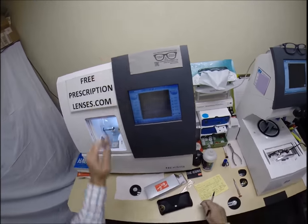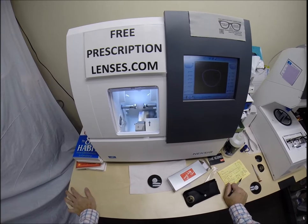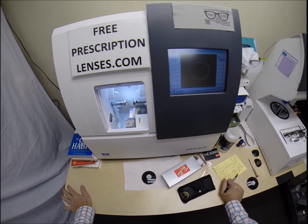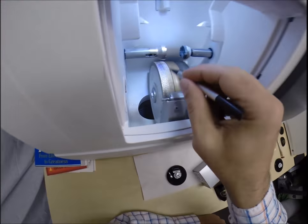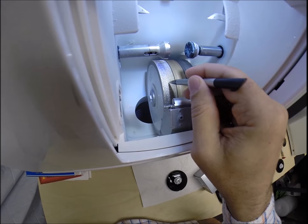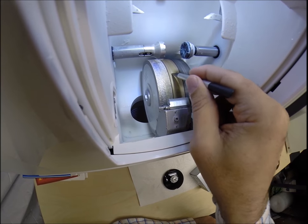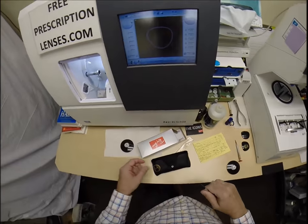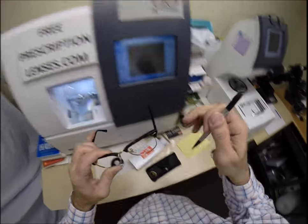This is the edger — this is what costs forty thousand dollars, it weighs 200 pounds. It'll do all the work while I run my mouth. I recommend everyone go out and buy their own, then you can cut your own G15 polarized lenses at home. The actual cutting wheel is a heavy grit wheel that will grind away your lens material until it's the final size. This wheel in the center will put that channel — that little valley — put the bevel onto the lens so it stays inside the bevel of the frame.